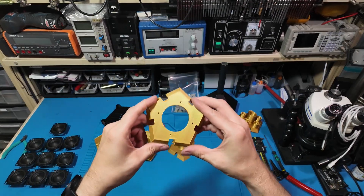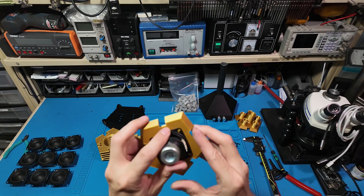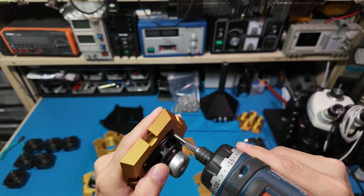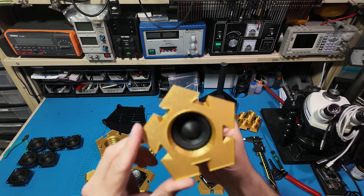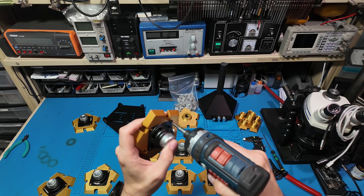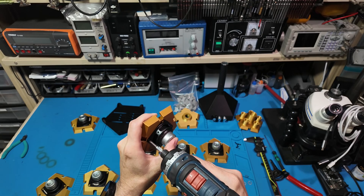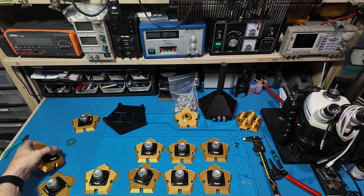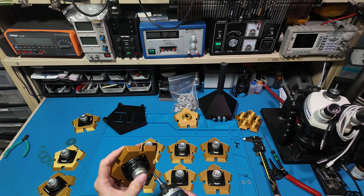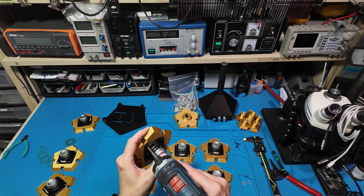The assembly is pretty straightforward. The ball houses a 2-channel amplifier which will power all 10 speakers. I wired four of them in parallel and the fifth one in series. If my math is even remotely close, I should land right around 8 ohms, keeping us right in the middle of the amplifier's safe zone. And trust me, I've learned my lesson about pushing amps.